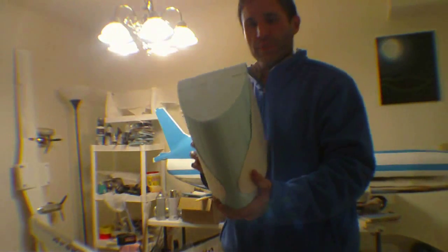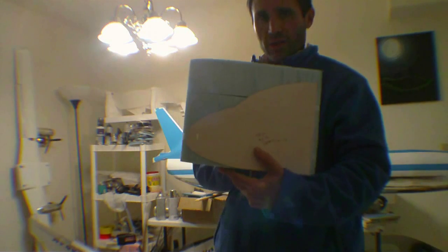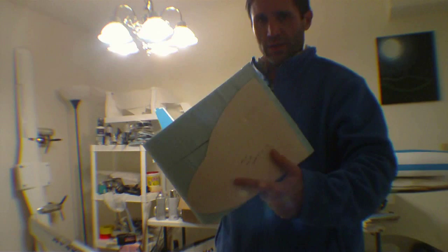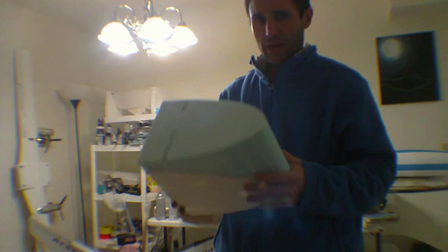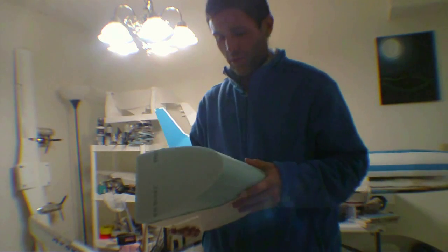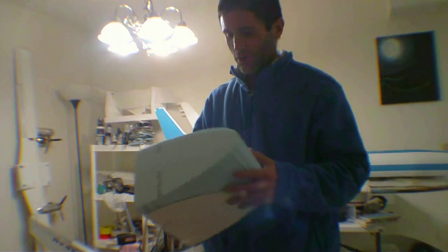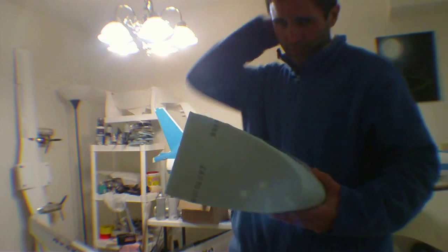Demon Driver back again. What you saw outside was the first cut — that was the top-down cut. Now we're going to do the side profile. Cardboard stencil, side profile, both sides. The reason why I don't really do any talking out there is because I'm really concentrating on what I'm doing — you've really got to watch everything that's going on. Sometimes if the hot wire is too hot it cuts into the cardboard, so you've got to really pay attention.